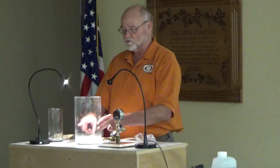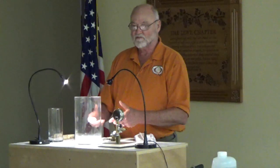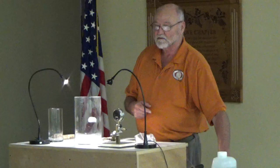Not only that, but when you pour this resin out, because you can reuse it, you don't want to waste it. It's $90 a gallon, right? So if you've got 6 or 8 ounces in here, you're going to pour it in. Don't pour it into the new jug of the new stuff, but have a separate jug that you can pour it into. If that jug's half full and you're pouring that in there, what have you just done? You've contaminated everything that was in there. Not only did you lose them blanks, you lost a half a gallon. Okay? Oily woods are not going to stabilize. It's just not going to happen.